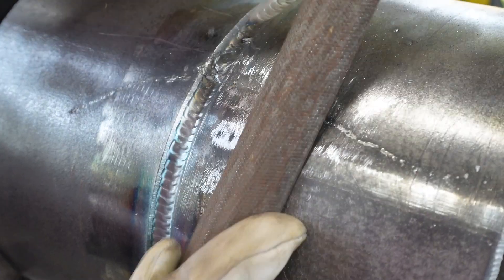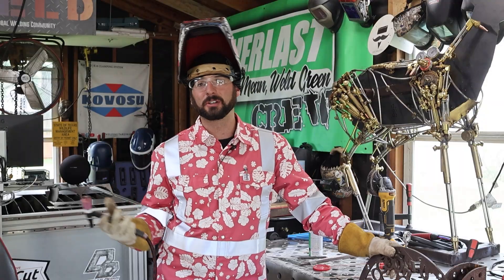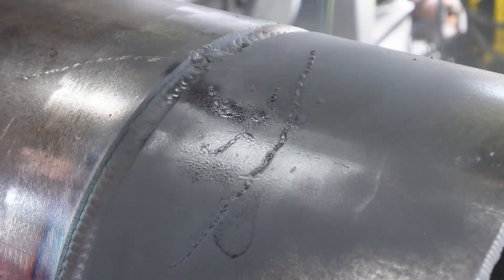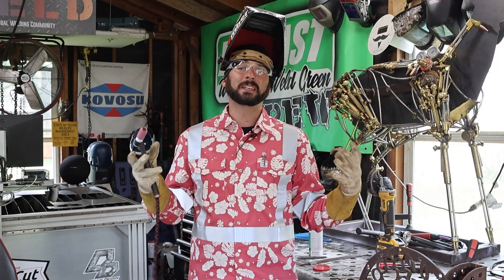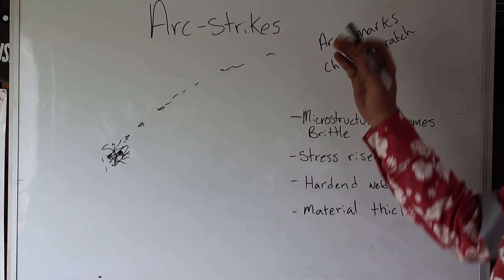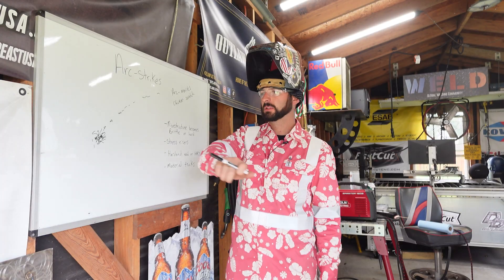These things are bad for certain reasons. From a visual aspect — not from a structural or pressure aspect — visually they're just not good looking. It's poor craftsmanship having all these little bumps and low spots on the actual part that you're trying to make, as well as leaving porosity. It doesn't matter whether you try to buff it off with a wire wheel or hit it with a file — some of that stuff is not going to come out.